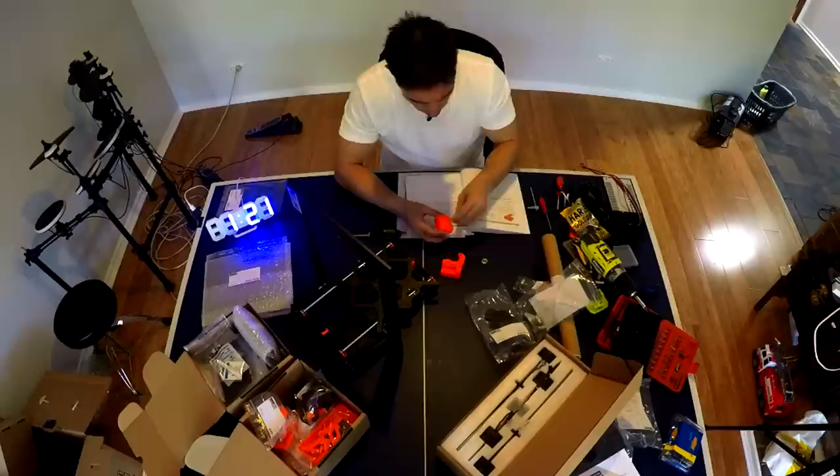I've sorted a small issue with children and I am ready to begin chapter 3 — X axis assembly. Let's go. It's always nice when something goes together and actually resembles the finished product, so this X axis carriage looks just like that. I had to pay close attention to the linear bearings to make sure the little races of balls on the inside are rotated 45 degrees from each other. Good attention to detail from the instructions.